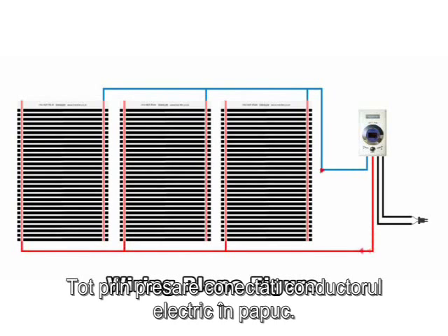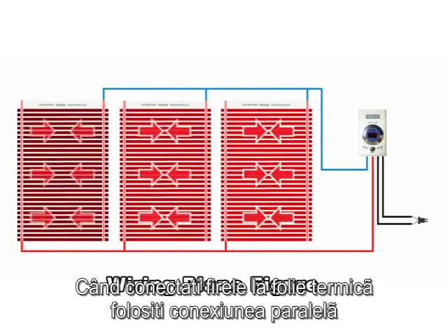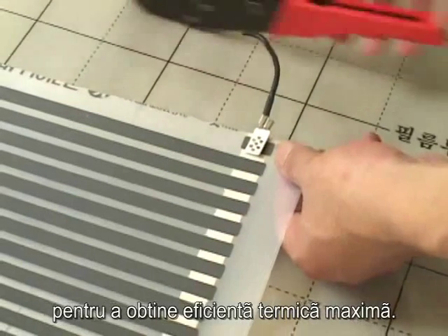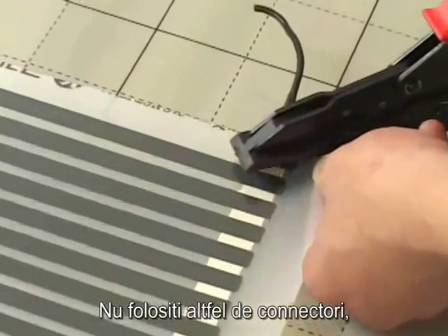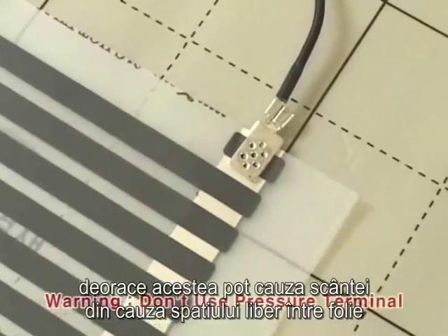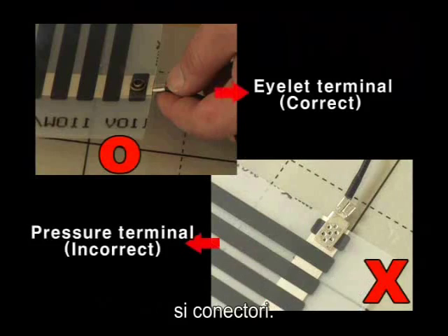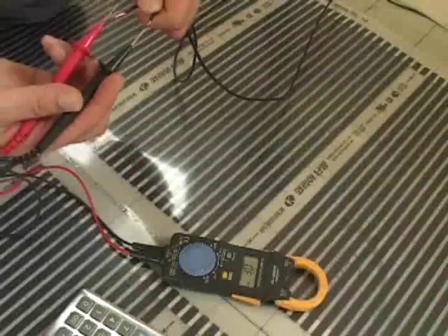With pressure, pliers connect the terminal with the wire. When connecting a wire to a hot film, use parallel connections or diagonal connections for maximum heating effect. For heating film, the pressure terminal is seldom used for the connection terminal because the pressure terminal may cause sparks due to the loose space between the film and the pressure terminal. We strongly advise against using the pressure terminal.